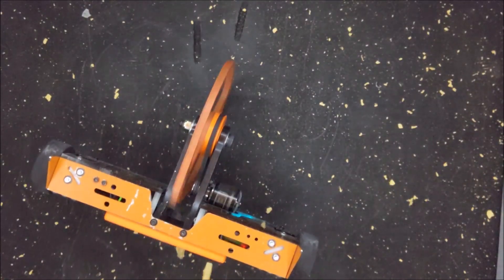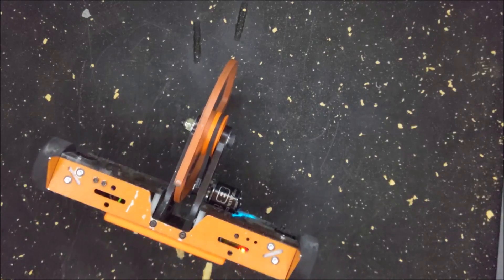The teeth on this pulley mean that the motor pulley is coupled directly to this one, and every time this one turns once, the motor has to turn about 3.1 times. That will always be the case, and whenever this stops, the motor has to stop instantaneously, which puts a lot of strain on the electronics of the motor and also on the motor's shaft.